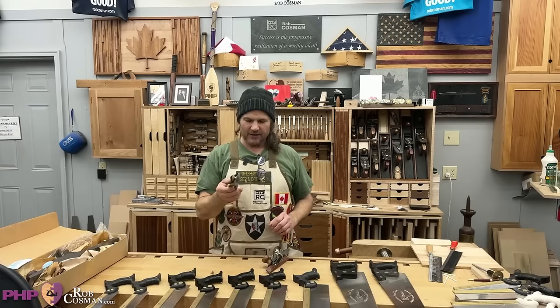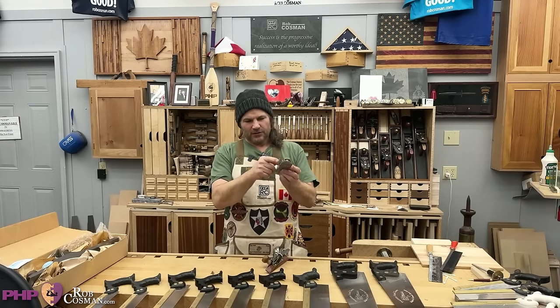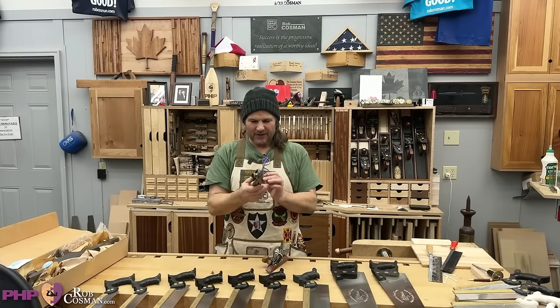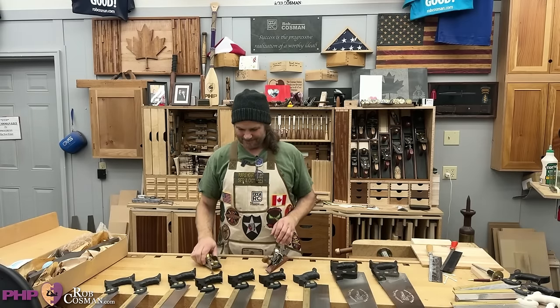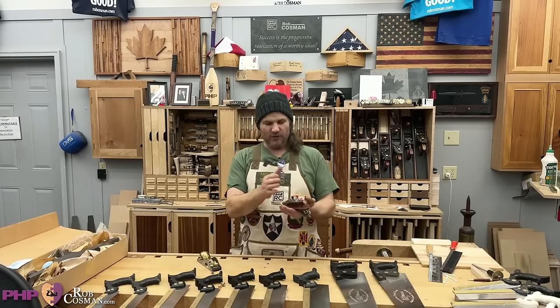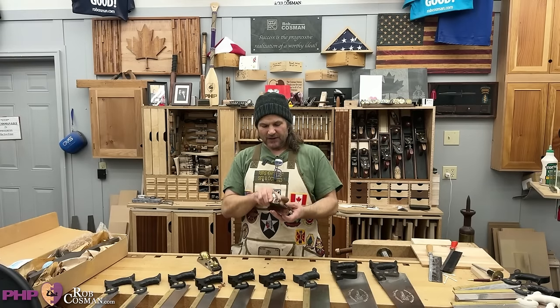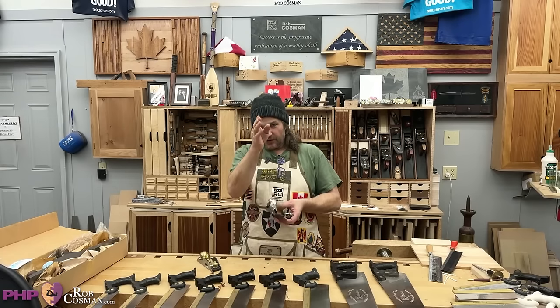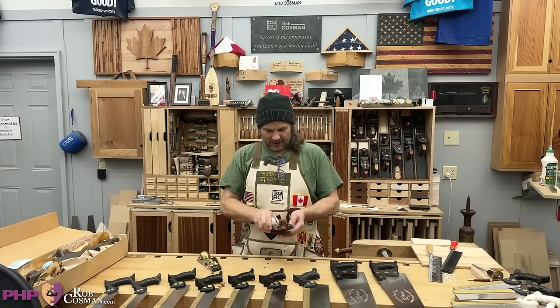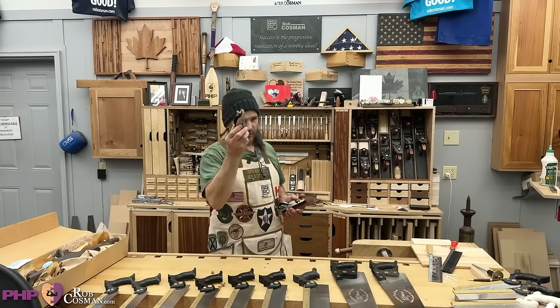First of all, the only thing this does is it allows you to cut full width, so your blade is exposed on both sides. It's not my favorite plane at all. This one, on the other hand, with a removable side plate and a fence, which is a big deal, allows you to do a very controlled cut with the capacity to go right into a vertical surface. I would put this in my top 10 list. This would be below my top 20 list.